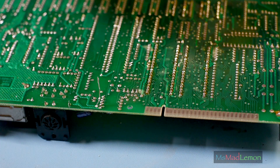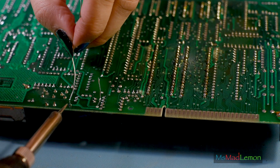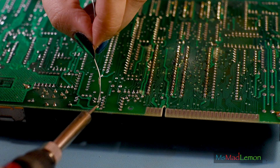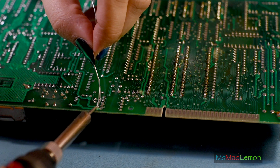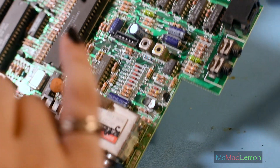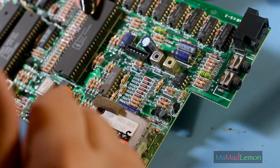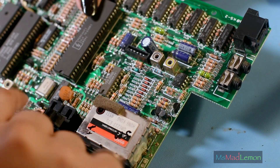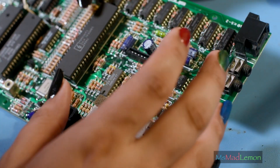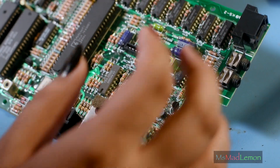Check on the other side here. It's actually already soldered. Just heat it up, make sure there are no dry joints. Just put this on there and trim. This method is way quicker. Now I've only got four left. That was way quicker than I thought — I thought I was going to be there for ages when I was using the pump. I really do not need the pump for this. It's actually not bad. I don't even need a braid. I'm not using a pump nor a braid — I'm just using my own technique here.